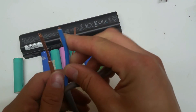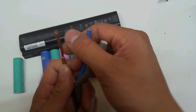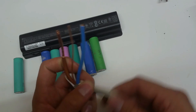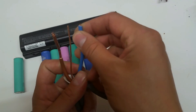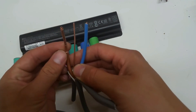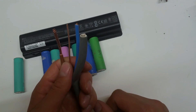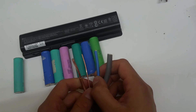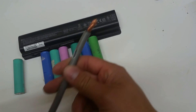That is twin and earth cable - twin and earth in Australia and England, probably something like Romex in America. 6mm can carry 30 amps quite comfortably and correlates to between American wire gauge 9 and 10 - I think 10 is 5.2mm² and 9 is 6.6mm². I'm going to use that, twist it, cut small bits of the insulation out and solder across with fuse wire, or strip the whole length and do it that way. That way we'll have two links going up the side giving us 12mm of surface area, and at the top we're going to use something similar but also recycled - tails for fuse boards.